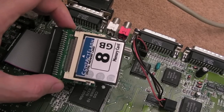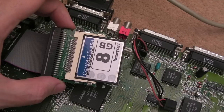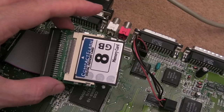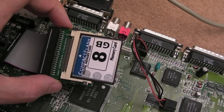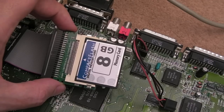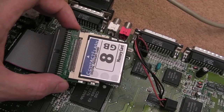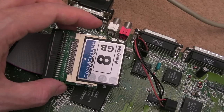So it's like it can't see the IDE. That's a huge clue. Whilst this works fine from floppy, look, flash, flash, it was trying to boot and then it's given up. I think the bus transceivers, assuming there are some, for the IDE port are the issue. Now, they might be shared with the PCMCIA slot. See, that can be a software error. So it's like it started to boot and then it's probably got some dodgy data because one of those connections on the transceiver is not working right.